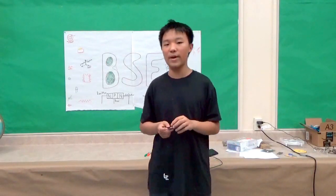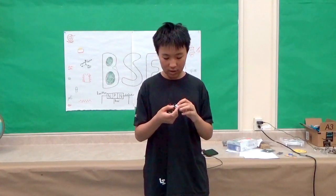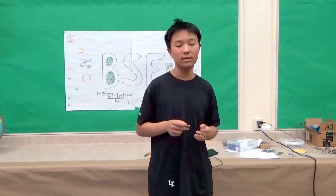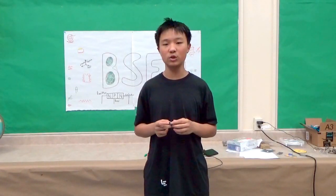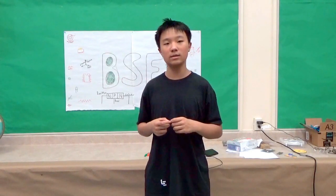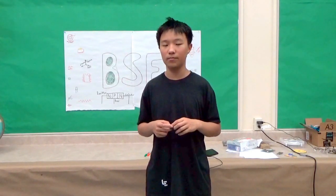And the other 2 capacitors are electrolytic capacitors, and they're bigger because they smooth out both the output and the input. They make sure that during the conversion, the energy that is being converted has a constant frequency, and it filters out whatever frequencies are too high.